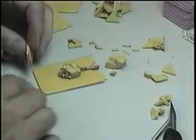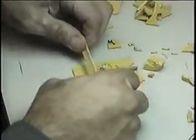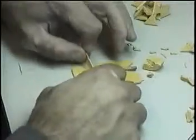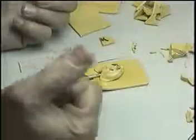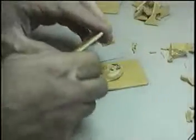Now, besides all this rubber that we fill all these settings with, what I do is I put an extra rubber, I tear it out a little bit, and I make sure, with a little bit of pushing, of the elastic, that when I place this mold in the vulcanizer, the rubber is going to melt, and because it's tight, all the rubber is going to make pressure to the cavity in your rubber molds and your models.